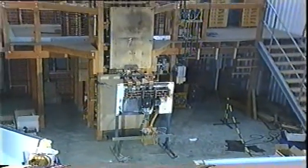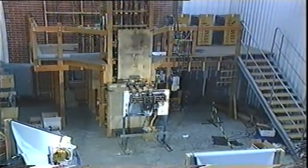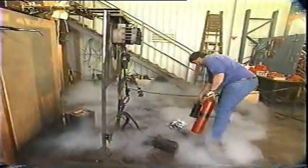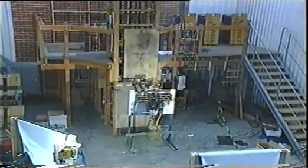The third 400 amp circuit breaker created a massive arcing fault, and clearly anyone in front of this MCCB would have been severely injured or killed. The breaker blew off the panel and started fires in the test cell. The view from the second recording camera shows the extent of the blast. In slow motion, molten metal can be seen escaping in all directions.